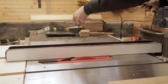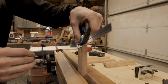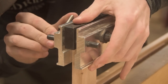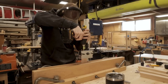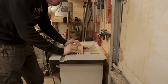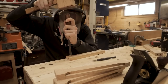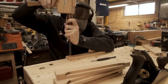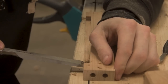So these first pieces that we're going to be adding into the internal section here are the cross pieces. Now these pieces I changed very last minute in the project because I had this really interesting idea that I thought would work out really well, and it kind of worked but also kind of didn't. So the idea here is that I wanted to have these tenons exposed on these pieces and have them unpainted while everything else on this cabinet was painted. So the way that I figured out I could do that is if I cut through mortises into our stretcher pieces and then cut round dowel holes into our cross pieces, I could make up some custom little dowels on the lathe that had one square end and one rounded end that fit perfectly into these holes. That would then allow me to add these pieces in after the whole glue up and all that, once everything was painted, and you'd get that nice look of these through tenon pieces that were just raw natural wood.